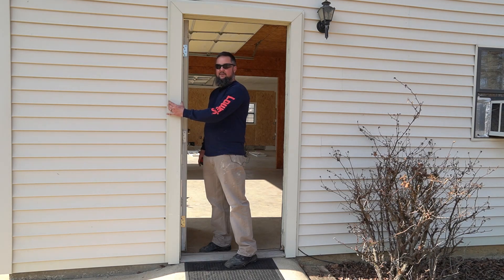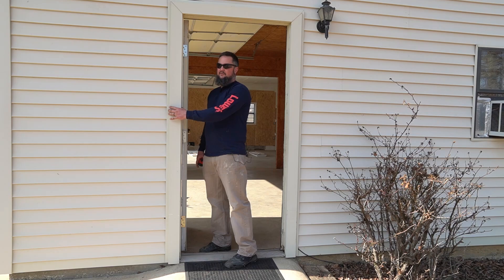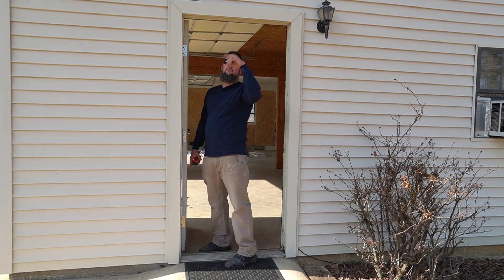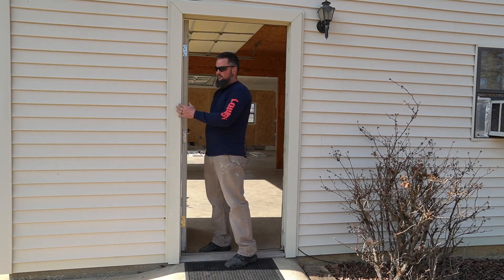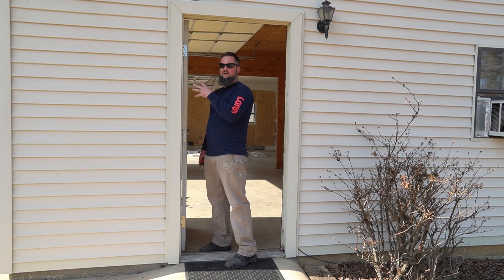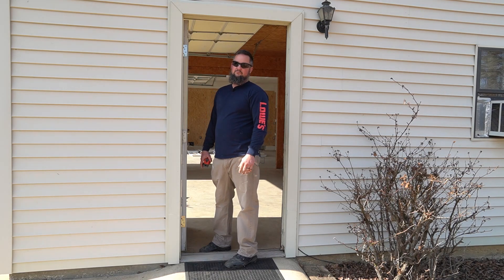This is an aluminum wrap on top of what I assume is a two-by-four. Because he's got an aluminum wrap and there's no roof over here, he's going to want to keep it — it's protecting the wood. So we'll have to take this off; the aluminum is going to get destroyed in the process, but we can reuse the wood, put the door in, insulate it, and then we'll have to rebuild that aluminum and install it after the door is complete.